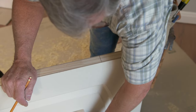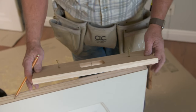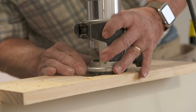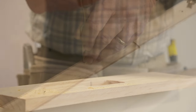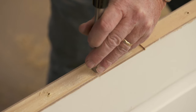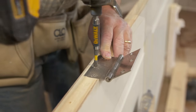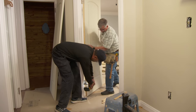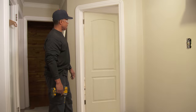I made a templating guide to cut our mortises so they'll be the exact size of the hinge. I'm going to use my router that's set up with a templating bit and a bearing on the top. The bearing will ride right around the jig. Now I have to take my chisel and square off these corners because the hinges you chose have square corners. Let's see how it fits — it's perfect.